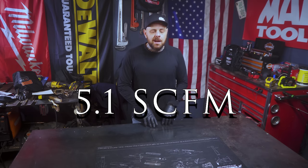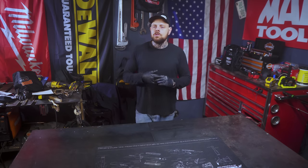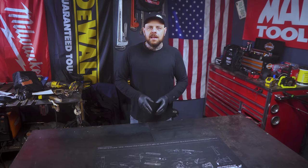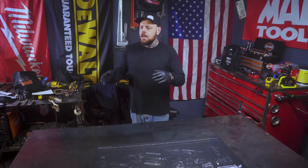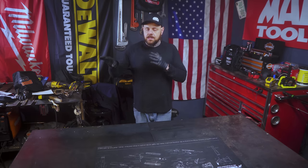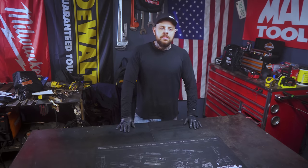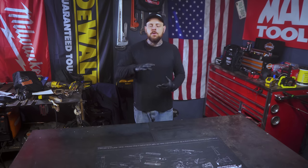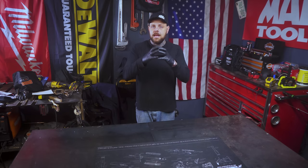5.1 SCFM is pretty much just enough to run some basic air tools. You could find a used 60 gallon, or spend a little more to get a better air compressor with higher SCFM, but for me this felt like a good purchase. The reasoning behind my purchase was the small size — and this is a 200 PSI max air compressor. To understand my thinking: imagine a 10 gallon tank where you're compressing air down to a certain amount, say 100 PSI, to fill it.